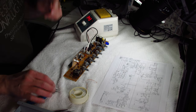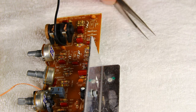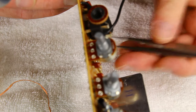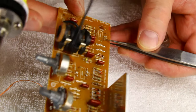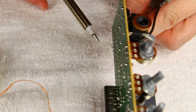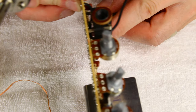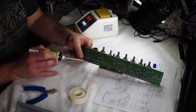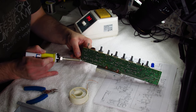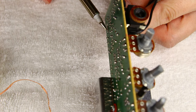Alright, kind of ugly — we'll fix it. What we want to do then is take tweezers and soldering iron. Basically all you do is grab onto one of the leads with your tweezers on one side, melt the solder on the other side, and pull the orphan pins out. If you've got everything set right it should be pretty quick. You can also just push them through with the soldering iron if you can't grab hold of them with the tweezers.